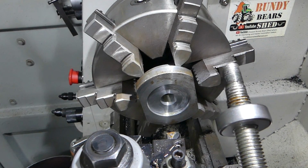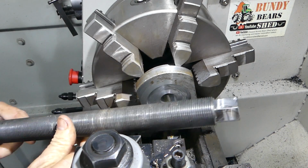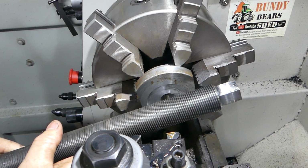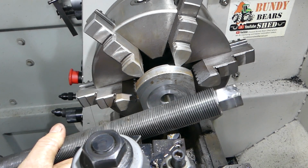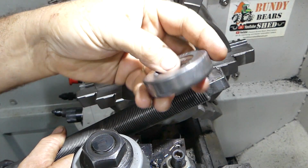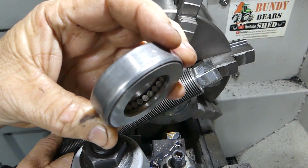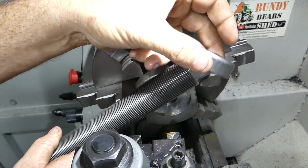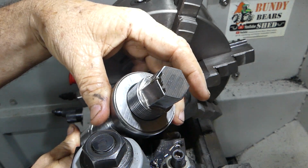So anyway, I went to the auction, as you know, and I found quite a few pieces of 1 1/4 threaded bar. And I thought, wow, look, that's high tensile, that's the go, I'll hop into that. So I got that, and I machined a few 15-16 flats, and this thrust bearing here, if you can see down the side there, that's a thrust off a Ferguson TE20 Kingpin. So at 1 1/4 it fits down here nicely.